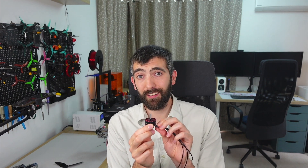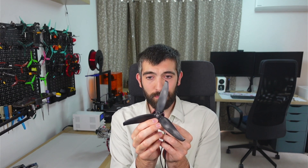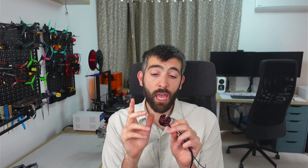The 2812 is a big motor with a lower KV, so it's really suited for much heavier props — something like the 7.5x4.6 from T-Motor, a massive prop with a massive chord designed to produce a lot of thrust, or maybe a heavy 8 or 9 inch prop. It's really not going to perform very well on typical CineLifter props like 7x4x3 or 8x4x3 because the KV is too low — it's got so much torque but not the KV to drive those props to higher RPMs.